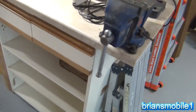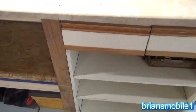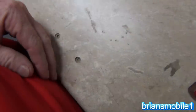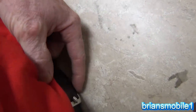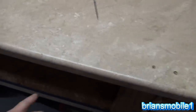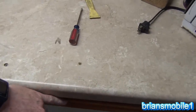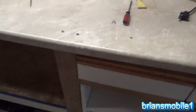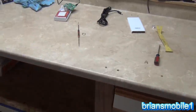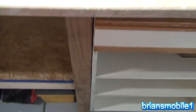When I was building it, I just did some marks on the ends to show where everything was going to end and land. This is about thirty inches. How high is this workbench? The height's up to you. This is at my waist — my belt buckle is right on top. That's where I like my workbench to be, right about belt buckle height. A lot of woodworkers that really lean into it and are bending over and planing like it to come to the middle of your pinky — so measure that and that's how high your workbench should be. If you're a mechanic, do it at your belt buckle; if you're a woodworker, do it mid-pinky with your arms straight down.